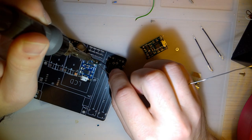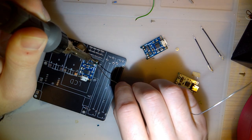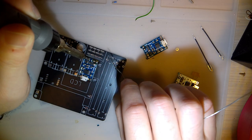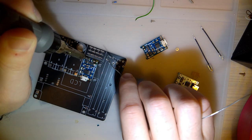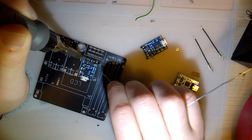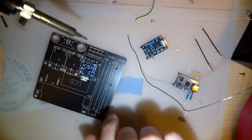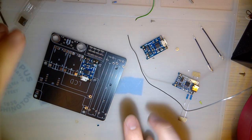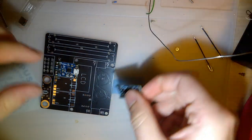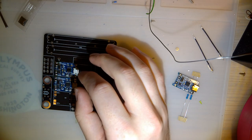So for those that haven't seen the video where I tested this circuit out, the idea is that I'm using three electrically isolated switches to switch these three modules from series to parallel, and I'm leaving the grounds floating on all three of them. That way, when my circuit is on, they are all in series, and yeah, it should be fine.